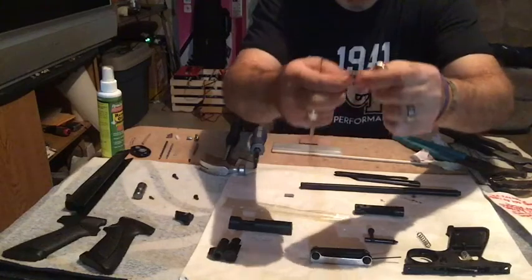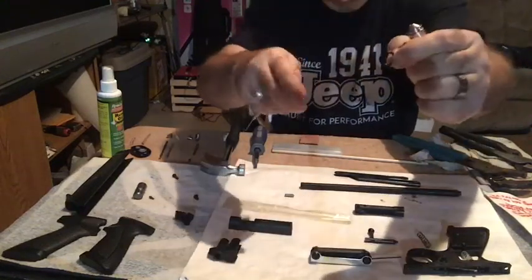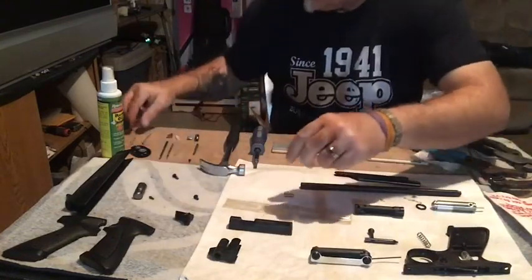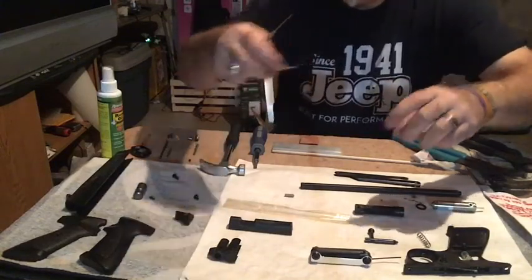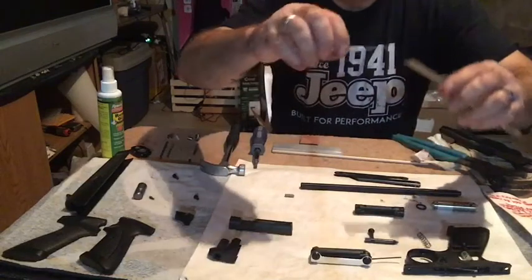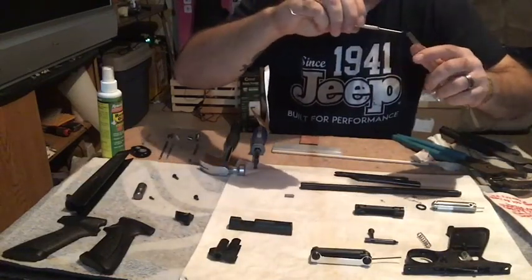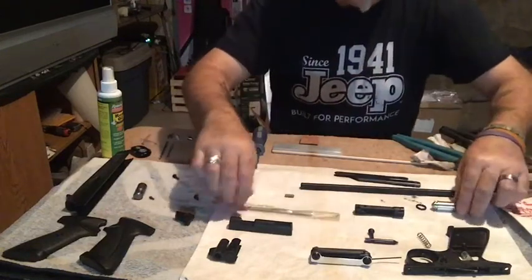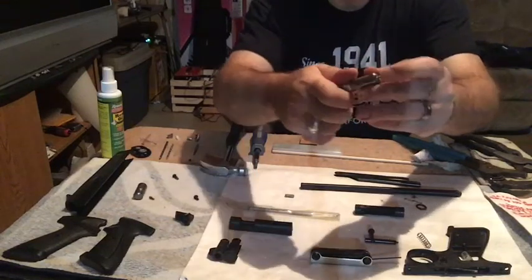It's a pretty tight o-ring with decent thickness, so it's not the easiest thing to get off. I initially tried using the end of a paperclip and had problems getting underneath it. The dental pick tool worked very well. Now we're ready to crack it open — what's inside is under pressure because there's a compressed spring.